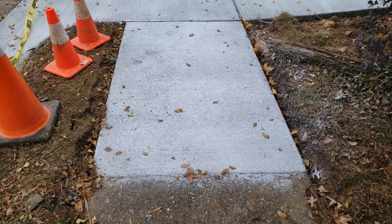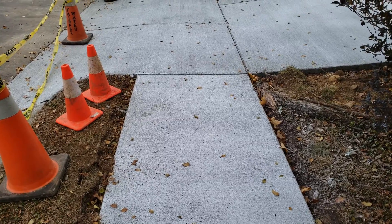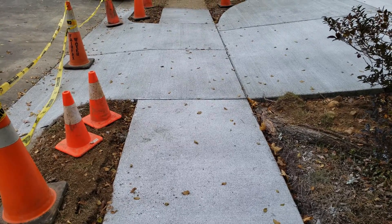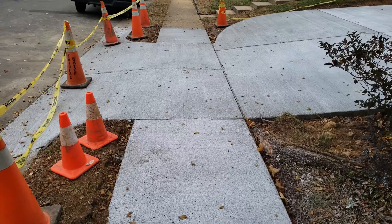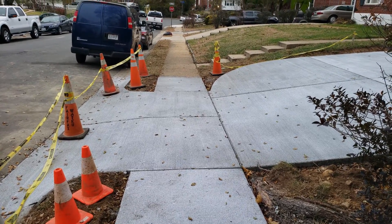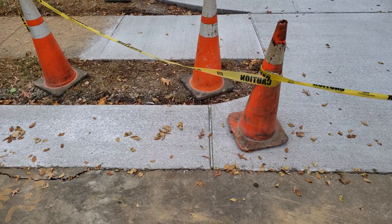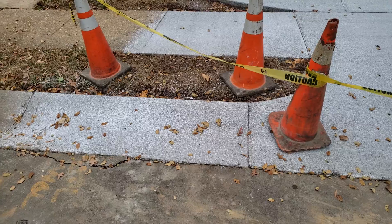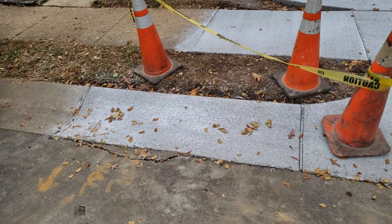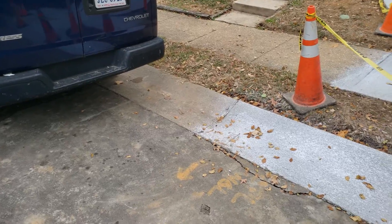When we went to cut through, there were two smaller sections of sidewalk that would have been left, so we're required to have at least a four-foot section, and you can see we added those on both sides. Same deal on this side with the curb cut — we would have been left with about a two-foot section, so we came down, saw cut, and left a six-foot section there and a six-foot section remaining under the van.